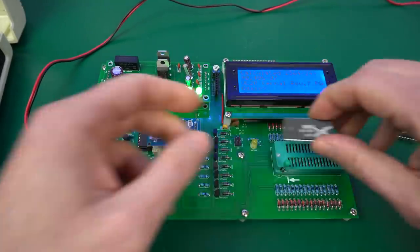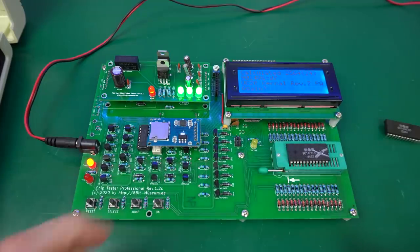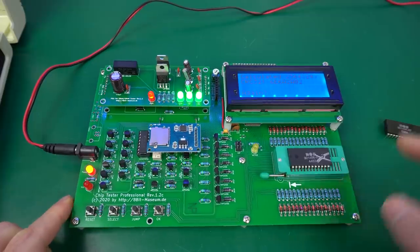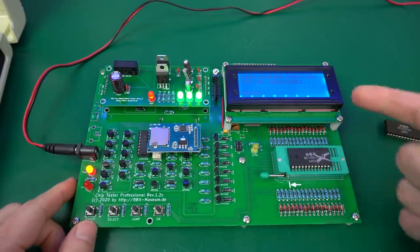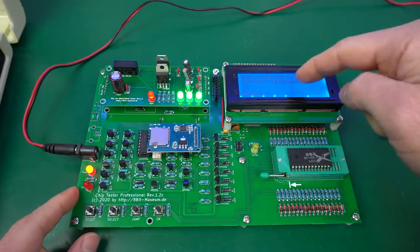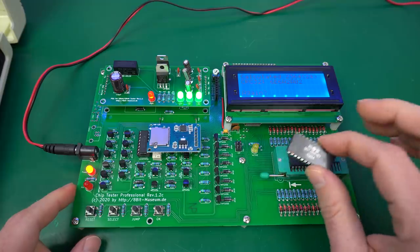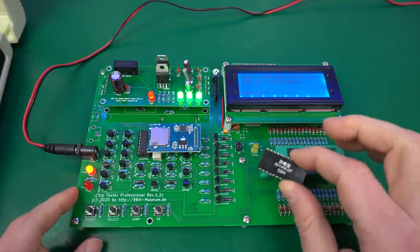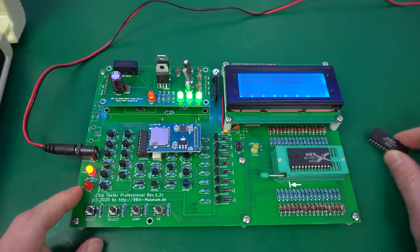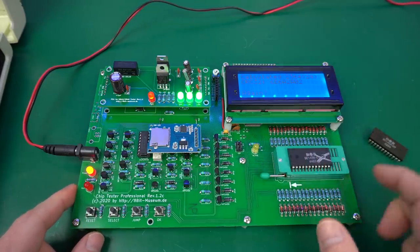So this is very interesting. It read something, so it wasn't totally dead, but the CRC came back and didn't match anything in its database. It clearly knew not just about the VIC-20 kernel ROM but different revisions — enough to know that the working one was revision 7. So I'm going to say, without going any further, that yes, this ROM is just not good at all.